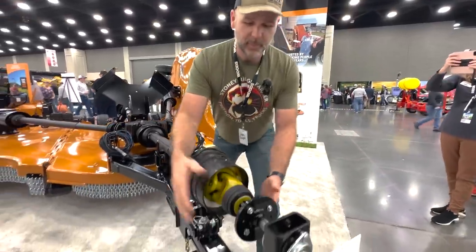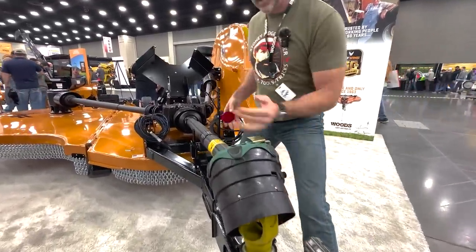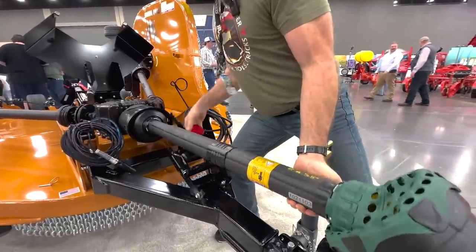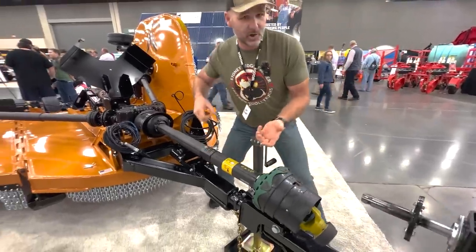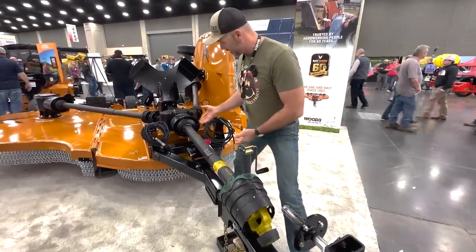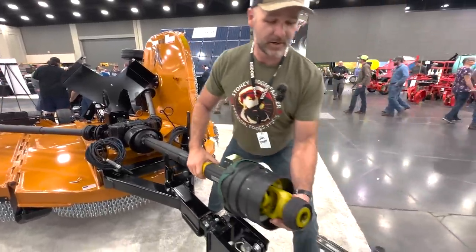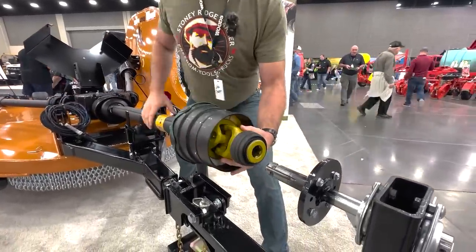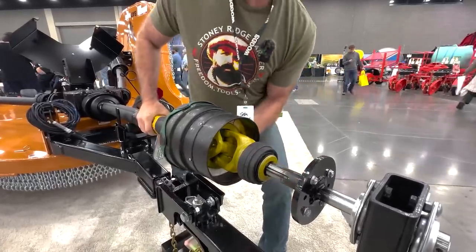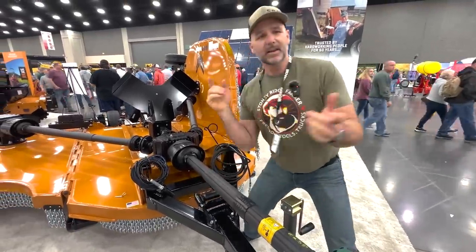With the Woods Batwing, you pull this collar back — it stays back, it's unlocked. We pull this off, it loosens down. This is the Smart Lift System. Take the handle, lower it down. This weighs about 60 pounds. When we have to hook it up, you know it's going to be greasy, it's going to be nasty, and it's going to be a pain in the butt. All we do — take the handle to the Smart Lift, raise it up just like this. Take your collar, it's already cocked back, ready to rock and roll. Slips up onto your PTO shaft just like so. Bam — locked into place.